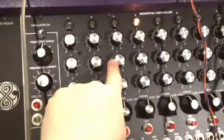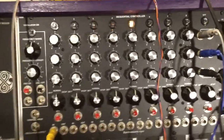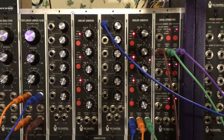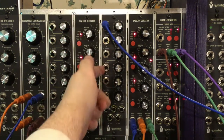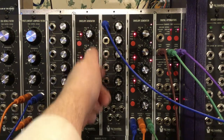Stage three on the Q960 is sending four volts. All the other stages are turned off. The envelope control inputs are over here — these are control inputs, and these are their associated attenuators: time one, time two, time three, time four.